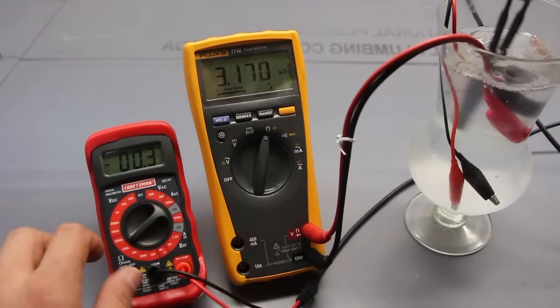Current, on the other hand, will kill. And it only takes, if I'm not mistaken, something like 1 or 2 milliamps. And that depends on the body chemistry. If you're lightweight, if you drank salt water like I just did, if you went exercising, if it's a humid day or not humid day, all of those can drastically affect how your body reacts to current. So be careful.